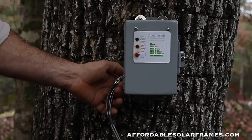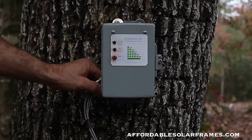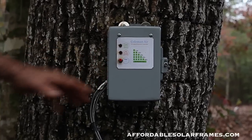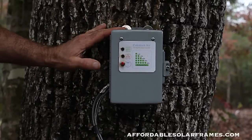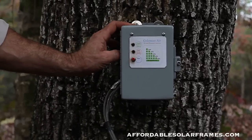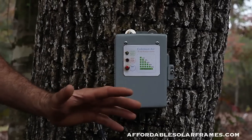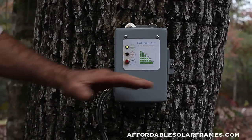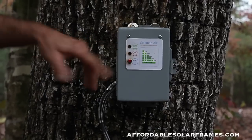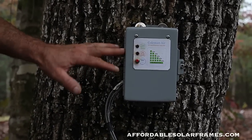This controller looks to the battery and not to the solar panel, windmill, or hydro generator. You want to keep a constant load on your windmill so it doesn't turn too fast. With the solar panels, you can wire straight into this and it simply disconnects them — this model has an option for both. When you're charging batteries, your battery is like a hungry man: if he's hungry, he eats fast; if he's not hungry, he eats slow. So no matter how much amperage you're pushing in, if the batteries are almost full, it has a hard time filling that last 10%. I like to run in the 60 to 80% range — it's the most efficient.